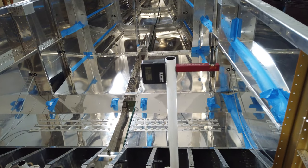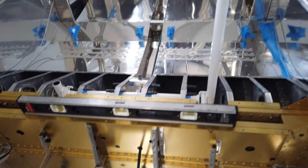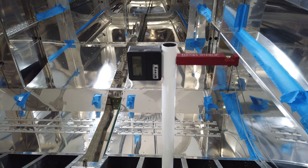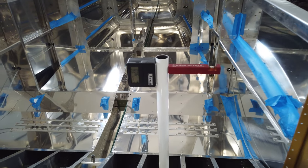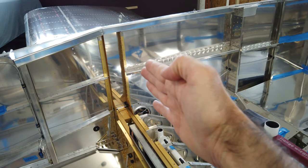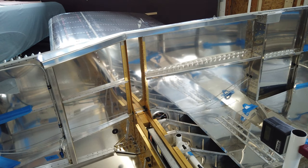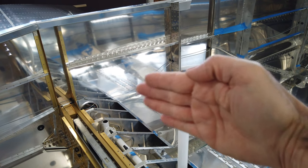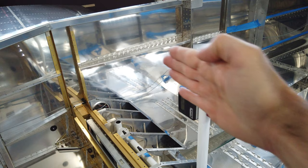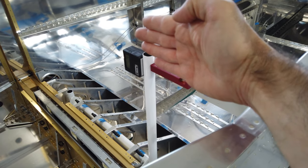I've got the pilot stick at 90 degrees, and that's 90 degrees to the level fuselage. I was using my magnetic bubble level but my digital level also has a magnetic base so I have them both up there. When you put your level on the stick make sure that they run across the fuselage 90 degrees to the longitudinal axis - you want it 90 degrees. You don't want your levels skewed because then it's going to pick up a fore-and-aft measurement. You strictly want a left-to-right measurement, so make sure your digital measuring devices are where you need them.